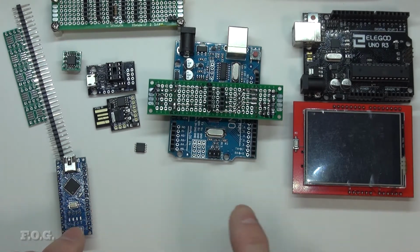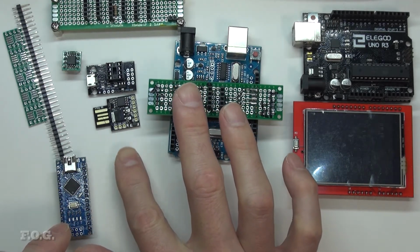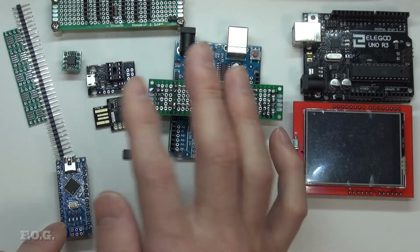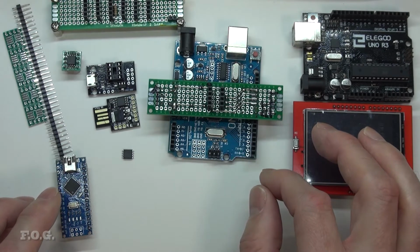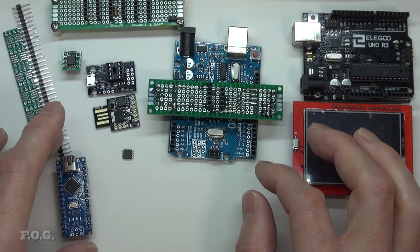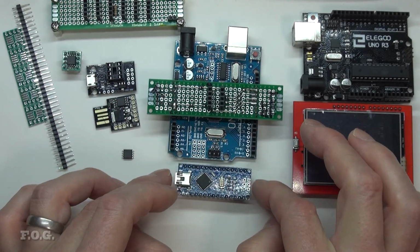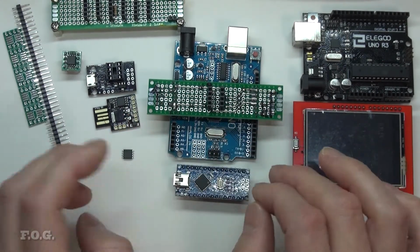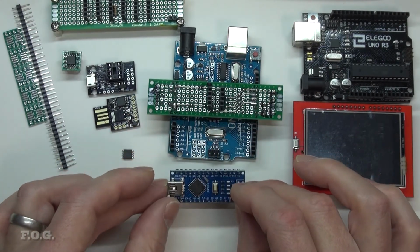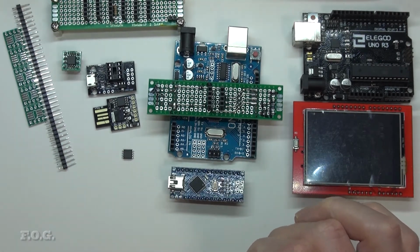So basically we only have two microcontrollers here. The ATtiny85, which is being used in the clean mode or the raw mode, nothing in there in programming, or can be loaded with, I believe, a Micronucleus bootloader. And these standard Arduino type devices, which at this stage, obviously there's probably a way to update the bootloader, and I haven't gotten to doing that. But fundamentally the way you would use these is with the bootloader, and these are all based upon the ATmega328.